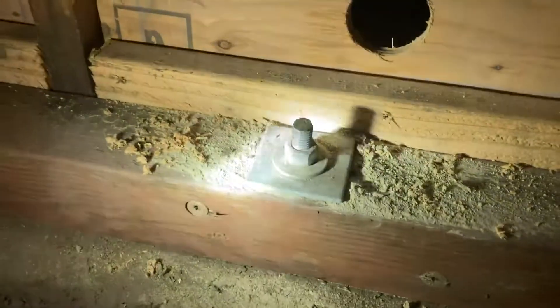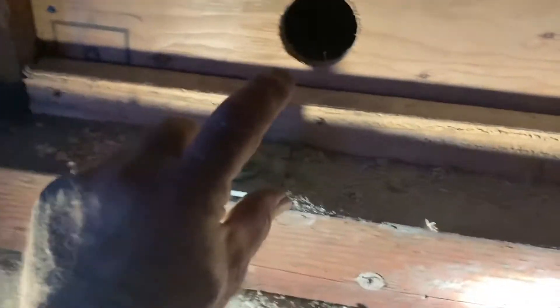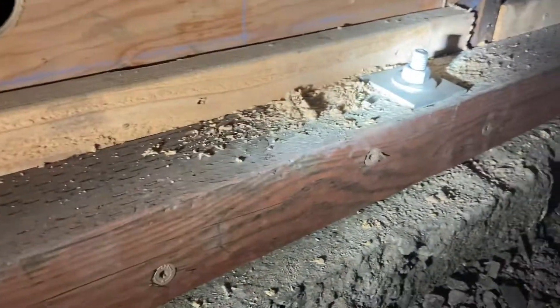Okay, brace and bolt. That's a bolt that's going to keep that piece of wood from moving — pins it down to the foundation. That bolt keeps the sliding action from happening. And there's a bolt here, and there's another bolt there.